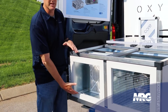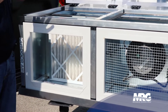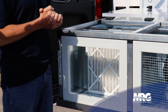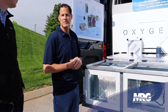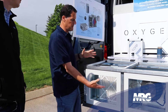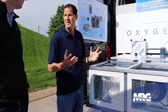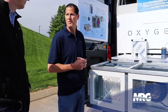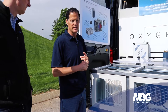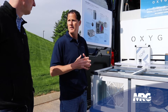A unit like this ranges anywhere from 16 inches deep to 30 inches deep, all the way up to 3,500 CFM. We can put that up into a drop ceiling, or flip it onto its side and push it up against the wall. Above that, we can go all the way up to 10,000 CFM — those units are typically put up on their side into a small mechanical room or janitor's closet. Because it's such a low profile, we can now add and improve ventilation by decentralizing the ventilation system, going floor by floor in buildings rather than using a large package unit on the roof.